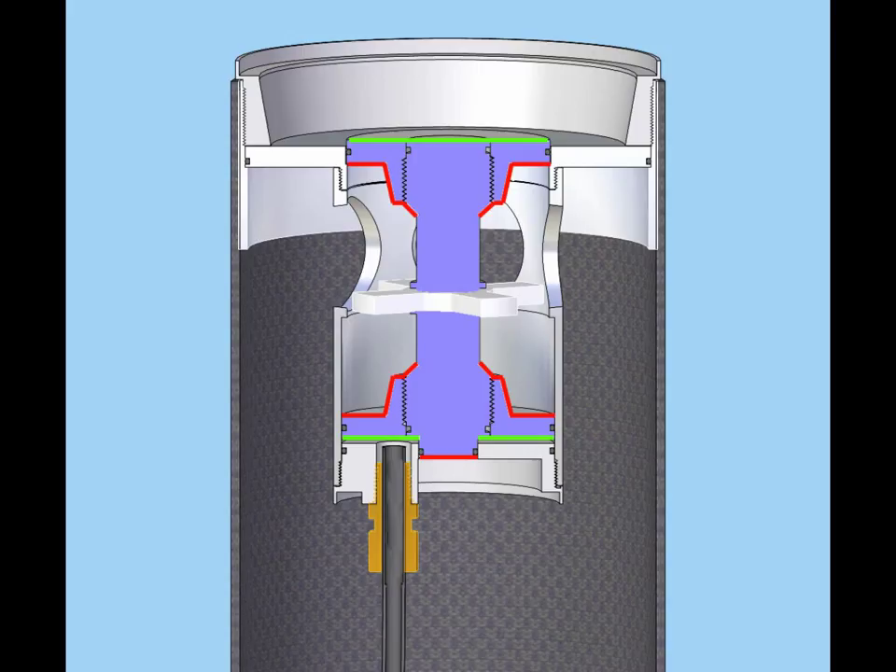However, what's not immediately obvious is that the bottom piston is of a larger diameter than the top piston, thereby providing a larger surface area than the top piston area and the stub combined. This naturally forces the valve closed when there's no pressure underneath the base piston. The difference in diameter between the two pistons is more evident upon highlighting the step.